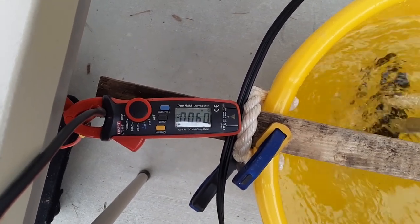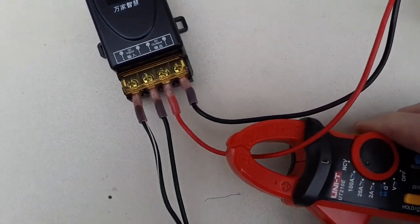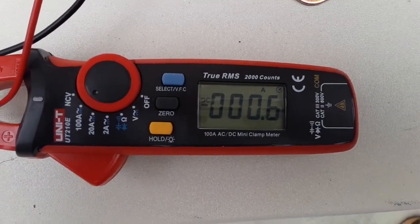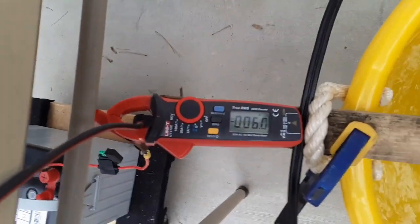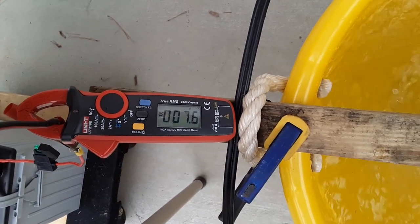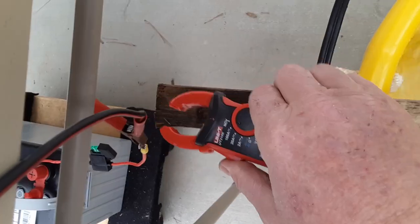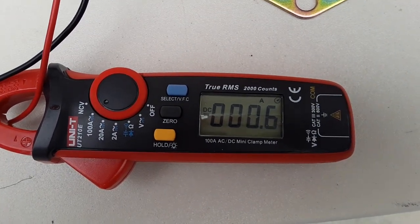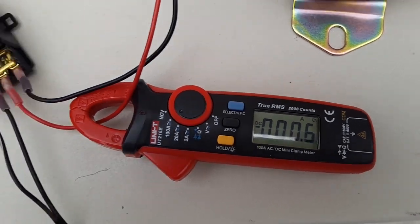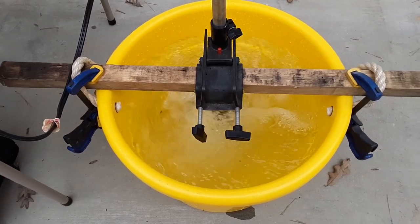This is my first reading of the trolling motor, and right now it's pulling about 6 amps. I'm going to go check the switch and see what that is pulling — and we're pulling about 0.6 amps, so that's pretty good. Now I'm going to increase the amperage pulled by the motor. We're reading about 14 and a half amps. Let's go check the switch — and the switch is still reading 0.6. So this is going to be safe. The amps pulled by this switch are going to remain constant compared to the amps pulled by the trolling motor. So everything should work out just fine.